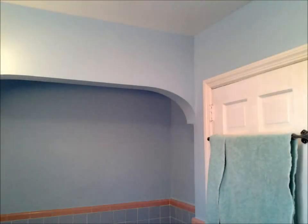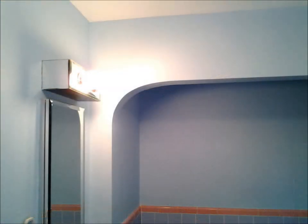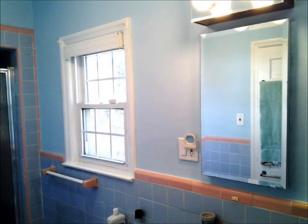After all of the repairs and prep work were completed, the ceiling, doors, window, trim, and walls were painted. The doors and trim were done in semi-gloss paint while the ceiling and walls were done using Benjamin Moore Aura Bath and Spa Matte Finish Paint. The matte finish gives a nice soft appearance as opposed to the hard shiny surface you get with traditional semi-gloss paints.